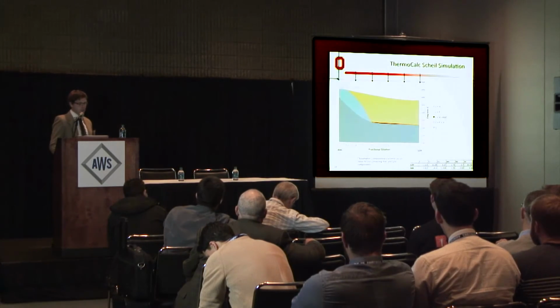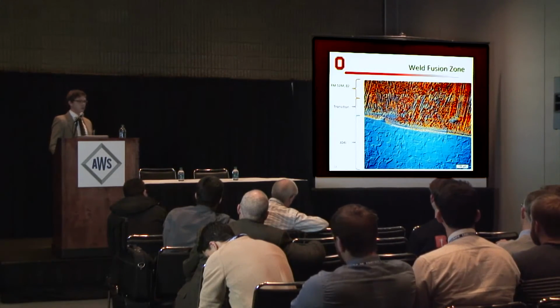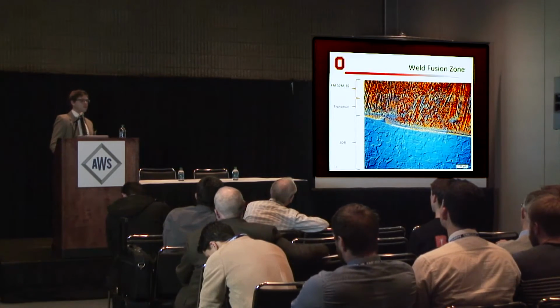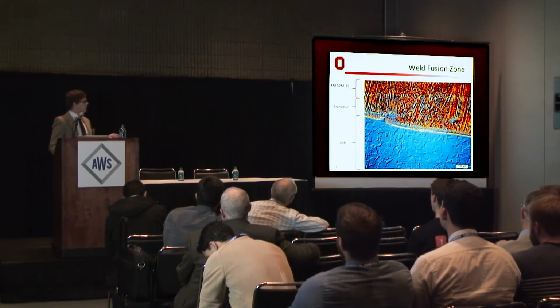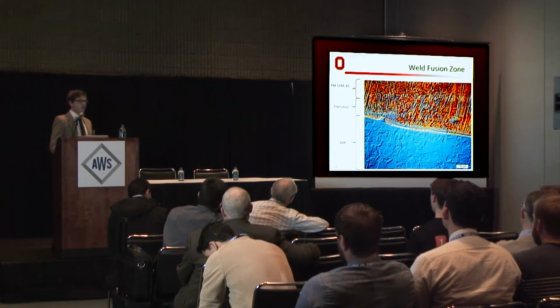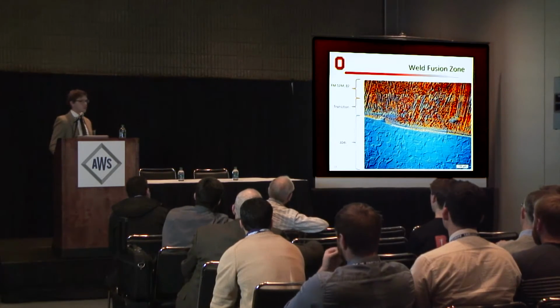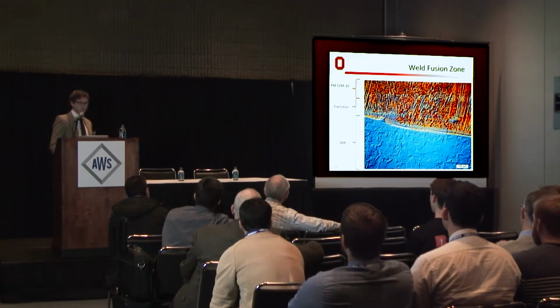I'll go into this later, but what's really important in this presentation is that this transition is very, very narrow when we're using CMT. And so we can't really compare TIG dilution meaning to CMT dilution, because TIG creates a bead that's more or less pretty homogeneous over the entire bead height or area, whereas CMT creates a very narrow transition zone, so we reach nominal filler metal composition very quickly over a very short distance, and I'll go over those distances later.